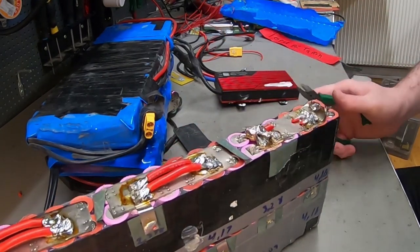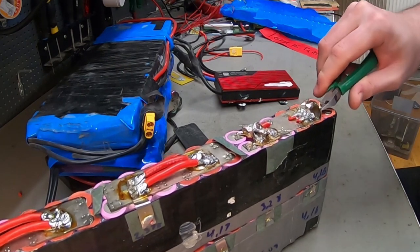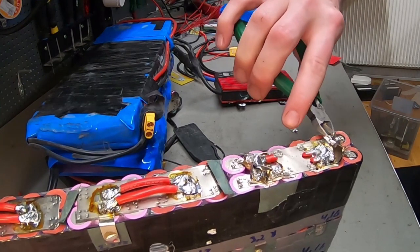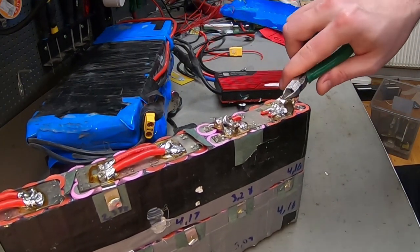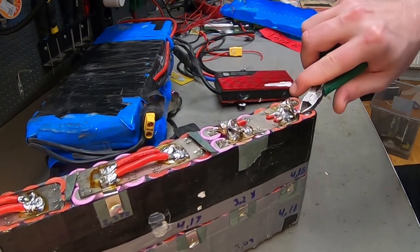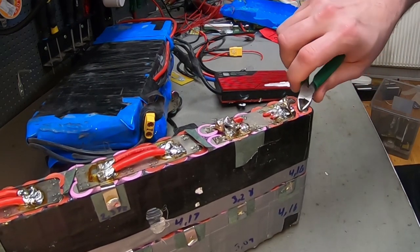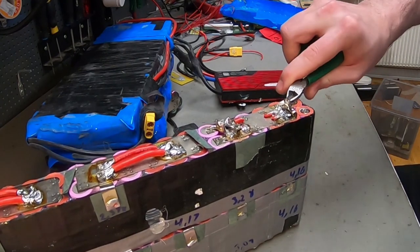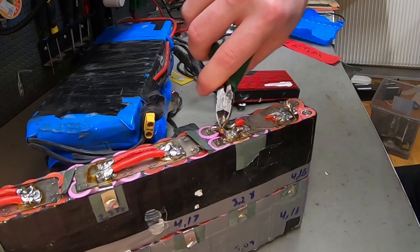Yeah, but what are you going to do when you need batteries that must handle 100 amps? You cannot really buy them from China because the Chinese don't really build batteries like that, because it's expensive to build good batteries that can handle 100 amps or more. So if you order something from China, you must be able to test that it can actually handle 100 amps without getting hot. So doing this yourself was probably their only option.